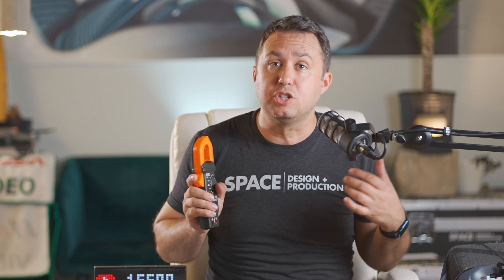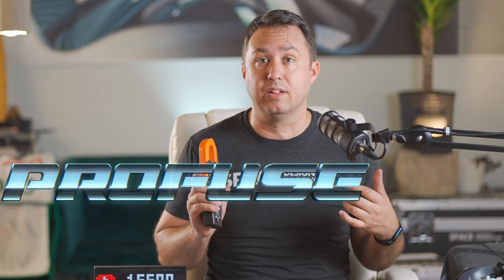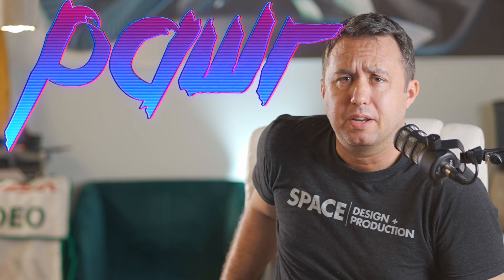While all this is happening, run outside and slap your amp clamp onto each one of these cables at the top of your panel and see what the meter says. As long as the higher number is at least 15 amps less than 80% of the number on your main breaker, then you're clear to buy at least one S19J Pro, or three S9s, or three L3 Pluses. Powering your bitcoin miners.